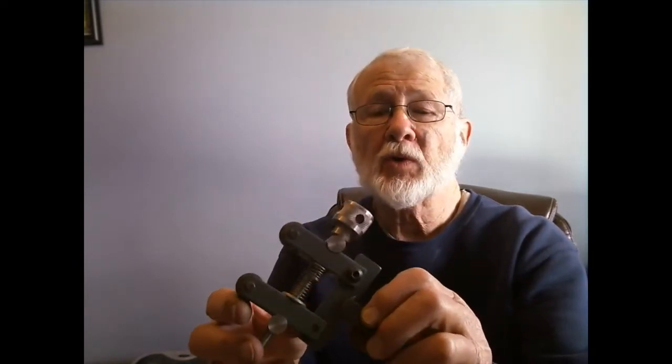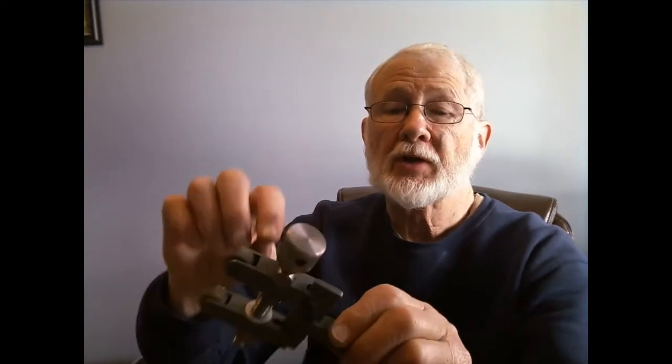We're going to be making a specially designed shoulder bolt, and it's going to be hardened. The reason I'm doing that is I want to make another one of these. With this one here, the bolts are just threaded bolts, and with enough action going on, the thread is going to wear and become sloppy. So I want to make a smaller one of these with custom designed shoulder bolts, and we're going to go through the process of how that's done.